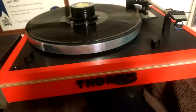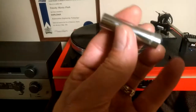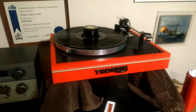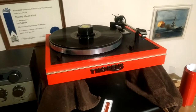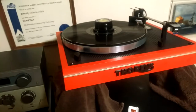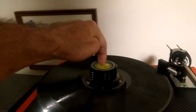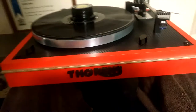One of the hardest things is getting these things tuned properly to get that magic bounce, and I think I just managed to do it — I'm pretty tickled pink. I've got this little eight millimeter bolt assembly, cleaned up the springs really well — there's another video preceding this one that shows that process — put talcum powder on them just to make sure they don't rust, as it absorbs moisture. There's also a method of finding the weak side of the spring, which you face towards the spindle or bearing assembly.